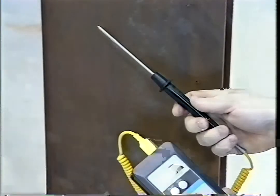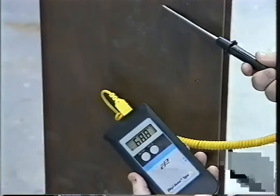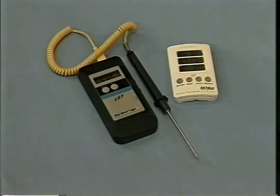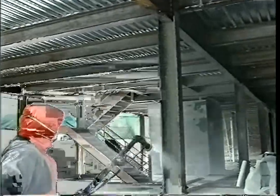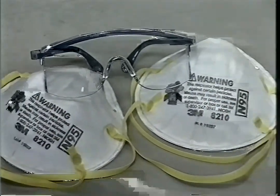When the temperature at the job site is less than 40 degrees Fahrenheit (4 degrees Celsius), a minimum substrate and ambient temperature of 40 degrees Fahrenheit shall be maintained prior to, during, and a minimum of 24 hours after application of CAFCO SFRMs. Protect skin from irritation by wearing loose clothing, and protect eyes and respiratory tract from airborne product by wearing NIOSH-certified dust masks or respirators certified N95 or greater, and goggles, safety glasses, or eye shields.